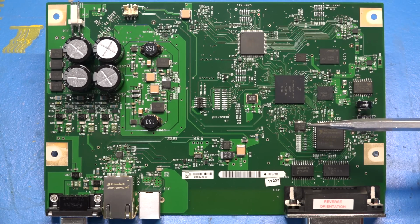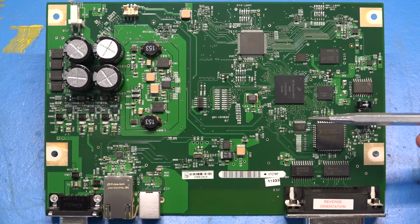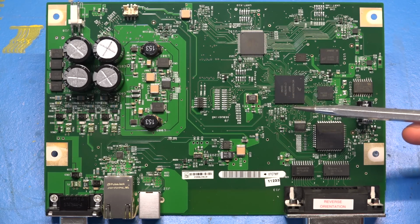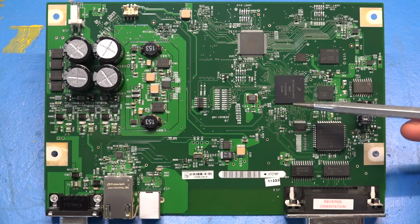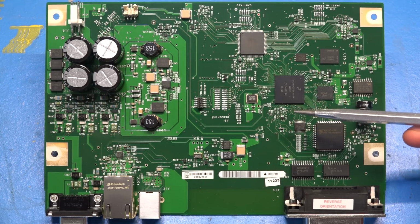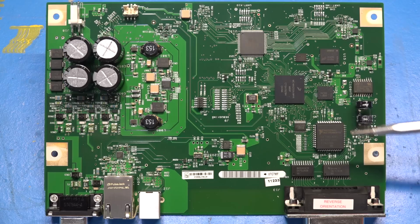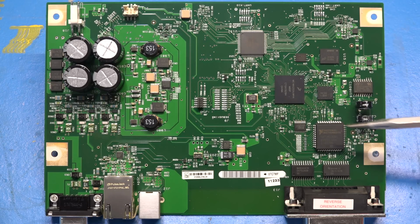At the heart of it, we have this IMX25 application processor from NXP. Interestingly enough, this is an automotive grade product, or at least it could be depending on which part number you buy. So you may have some additional resiliency for temperature and power supply variation. It's surrounded by some memory. Here on the right side, we have an ST real-time clock chip. Interestingly enough, it is backed up by 2 supercapacitors as opposed to a coin cell battery, which may be more common, but it may not need that.